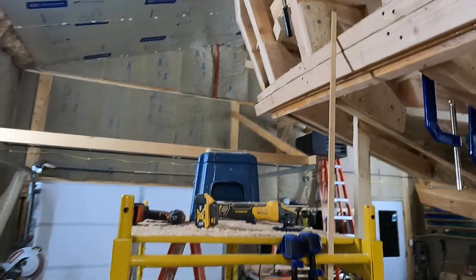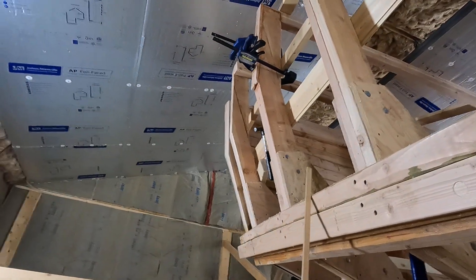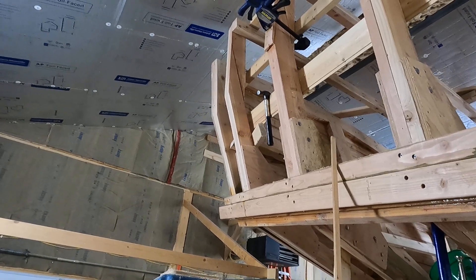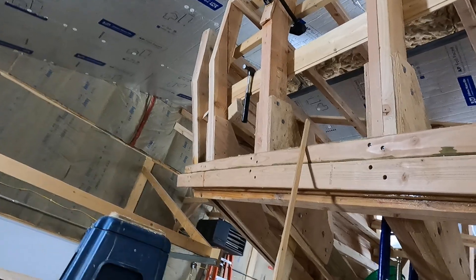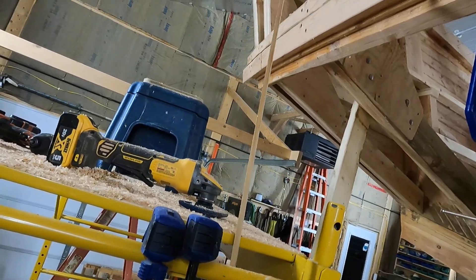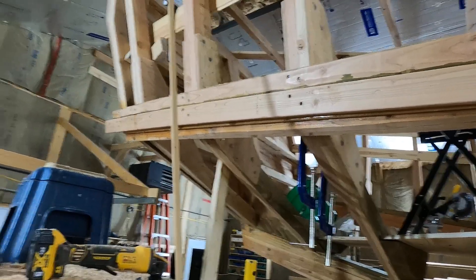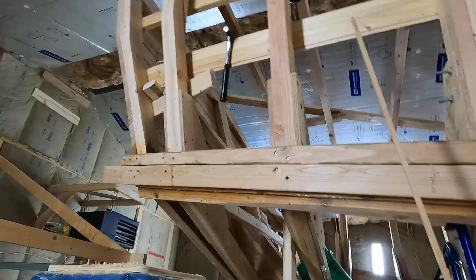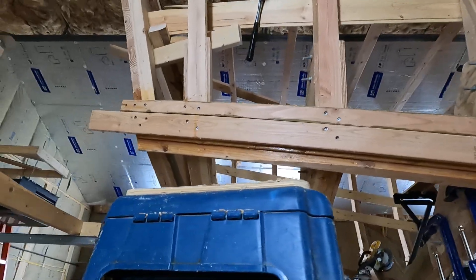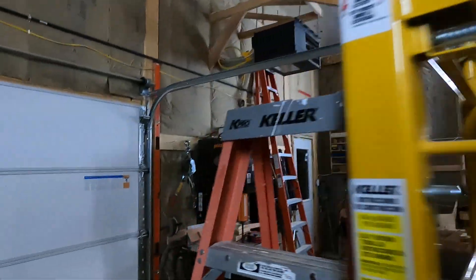Way back here — I don't know what caused it — but you can see I've got an extra three-quarter inch piece of wood clamped and glued on there. I came up a little short. It was going to cause a bow when I was laying my batten up there. Here's the batten I used to check the contour of the boat. So I just got a piece epoxied in there with a couple of screws to hold it in place. Tomorrow we'll be able to pull that loose and finish plating down that last frame to get the planking on there.